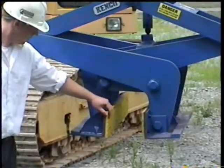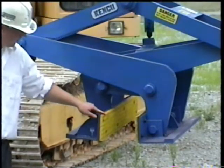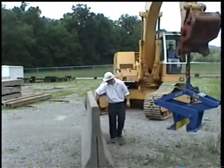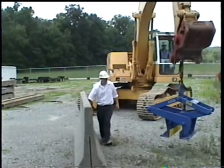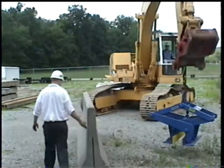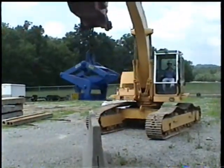Before using a lifter, make sure the pads are free of contaminants such as grease, dust, etc. Make sure the wall is free of any defects that could compromise its structural integrity. Remove any debris and dirt from the area of pad contact. Do not exceed the rated capacity of the hoist, the lifter, or the rigging components.